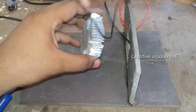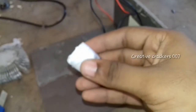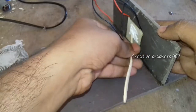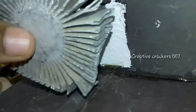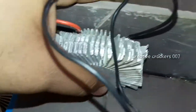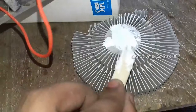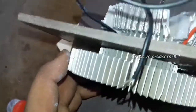Now it's time for us to paste the heatsink. The small piece goes on the side which is cooling and the other side will generate heat. Just apply a large amount of paste, and stick it on. I have applied the paste now, so it's time to fit the heatsink. Just give a tight press — it's now completed. Now repeat the same in the opposite direction. The Peltier module works via a PN junction: one side creates a heat surface and the other a cold surface. We don't want the heat surface, so we want to remove the heat using water to cool it down, and generate a cold surface on the opposite side, where we use the rectangular-shaped heatsink.